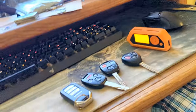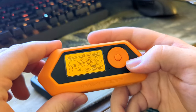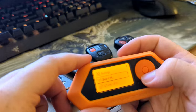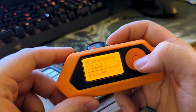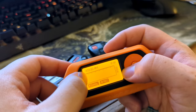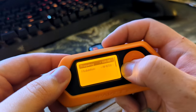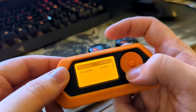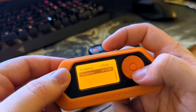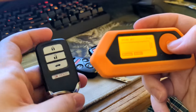We're going to see what we can pick up with the Flipper Zero. If you have one, you can use these settings to pick it up; if not, just watch for the entertainment value. Open your menu, go to sub-gigahertz, go down to read raw, but you want to change the configuration — right now we're scanning at 433, so change your frequency all the way down to 315.